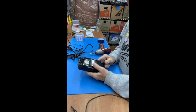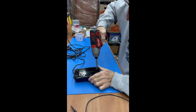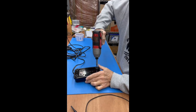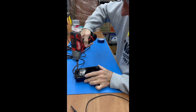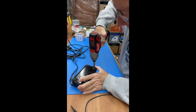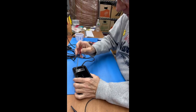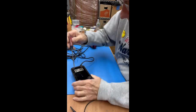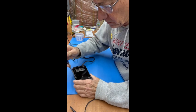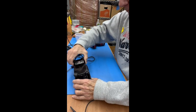We'll start by taking apart the foot controller. On this particular model, there are four screws enclosed in these wrap-around feet cushions. We'll take those out. I haven't opened this previously, so you'll be surprised along with me depending on what it looks like inside. This stuff is bakelite, so you can crack these if you're a little rough or get them in a bind — just take your time and get them pulled apart.